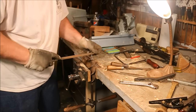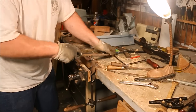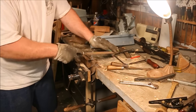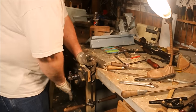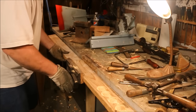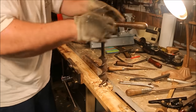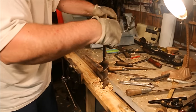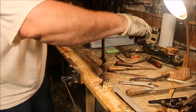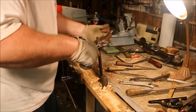We've gone through and repaired the screw on the pilot, sharpened the chisel edges, sharpened the spurs, and reduced the diameter on the flutes. Breakthrough — the auger bit is finally cutting all the way through.